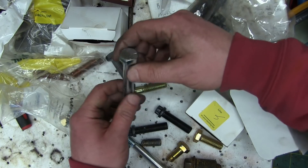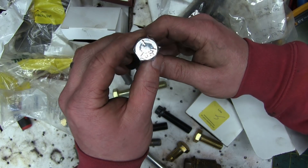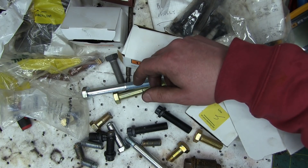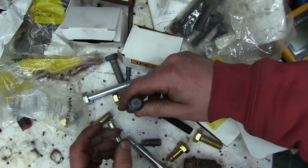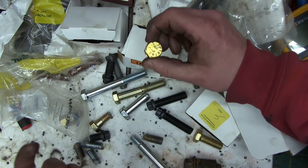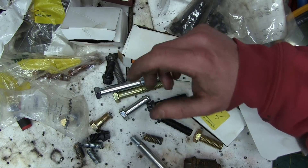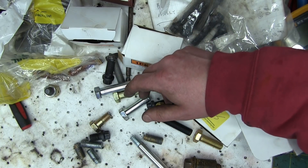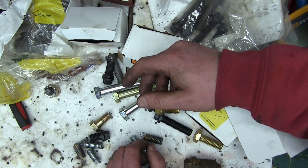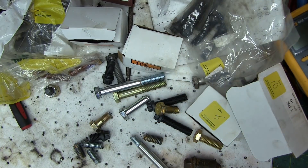768 — so that's the same. 770 is 135 foot-pounds. That was edifying and interesting. I would have never guessed the Chinesium would be as good as it is. Maybe they overbuild them because their quality control is so variable — they're all over the place, some way up high but some with interstices way down low, so they overbuild because their QC isn't great. Actually these are from Taiwan — JH marked heads. As long as you get them from a reputable source, they're skookum — strong as these for a tenth of the price. The American-made ones are fine, but they're not as strong as the JH. The mind absolutely boggles. This is one way to test them; we can also do a straight pull and just pull them apart — that'll be in a future video so we can compare results and see if our testing is cromulent. Thanks for watching.